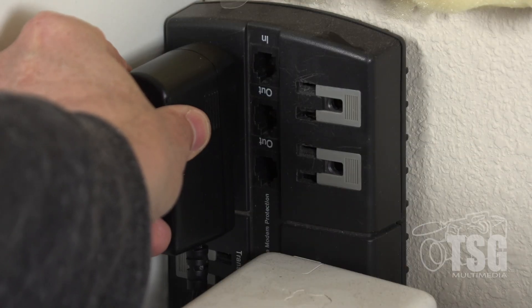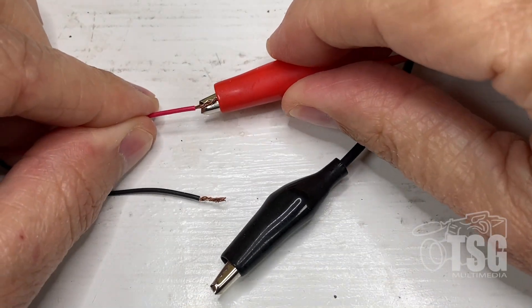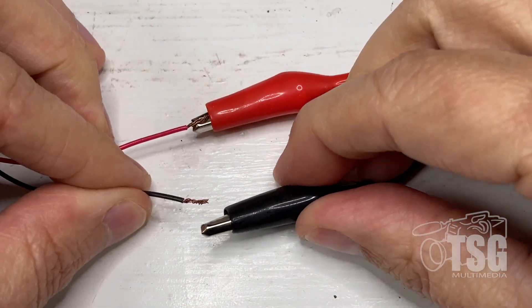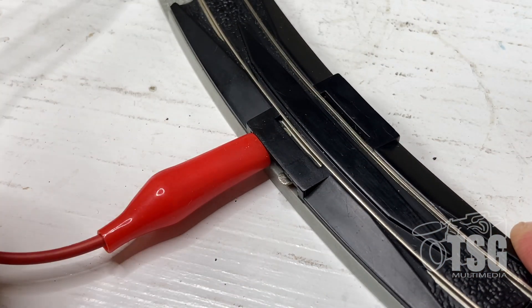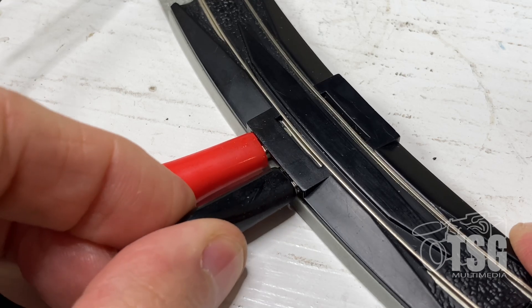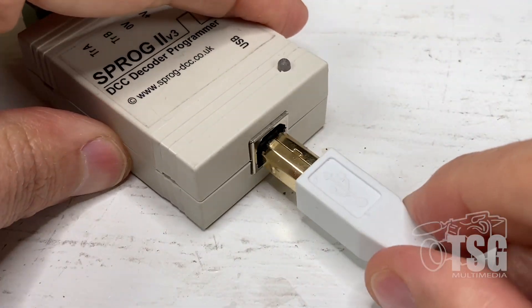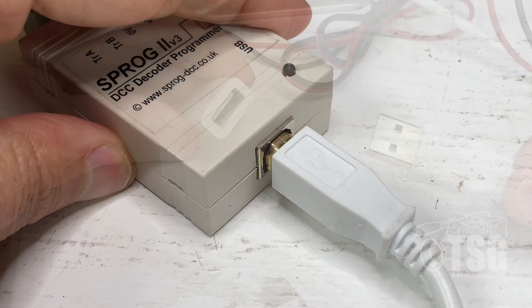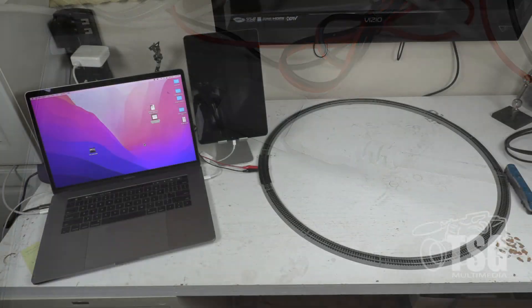The power just gets plugged into a wall, and then you take your track connections and connect them up to the track, like this. I use alligator clips because they're easy for me to deal with. Then you just take your USB cord, plug it in here, and then plug the other end into your computer. That's how you connect a Sprog device.